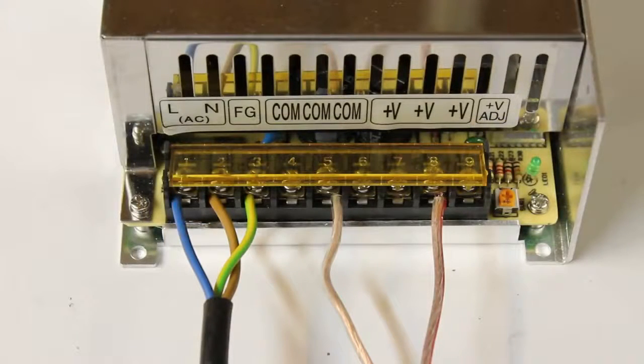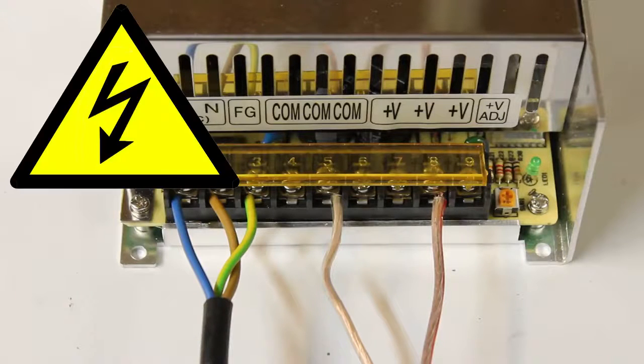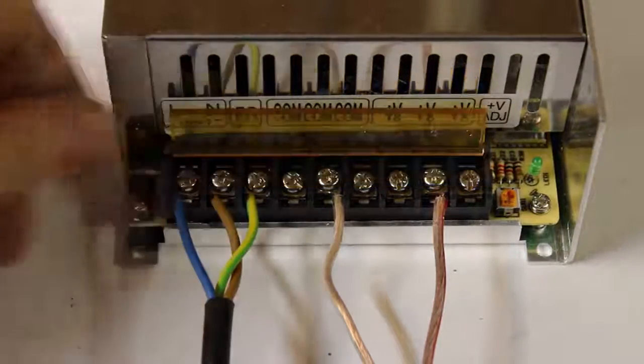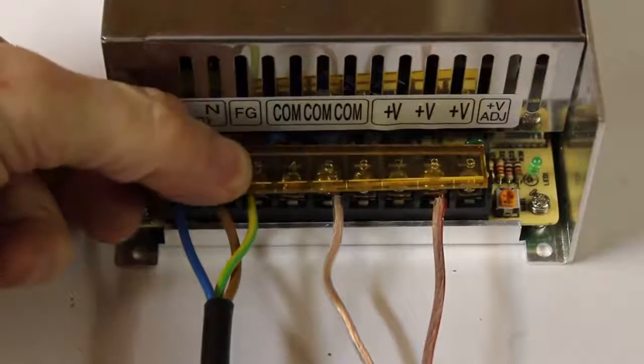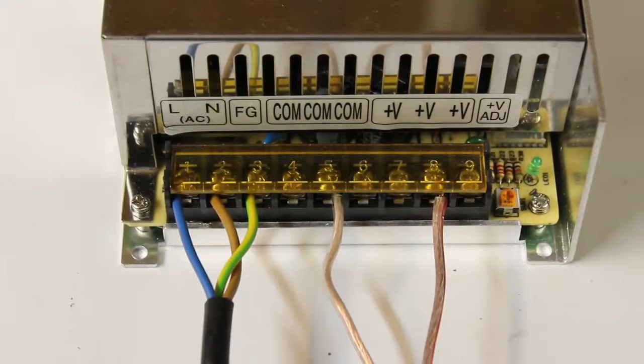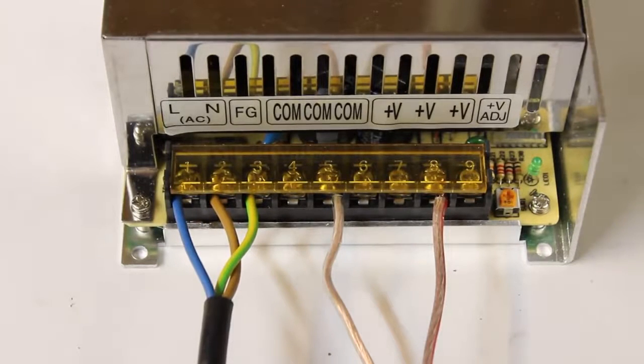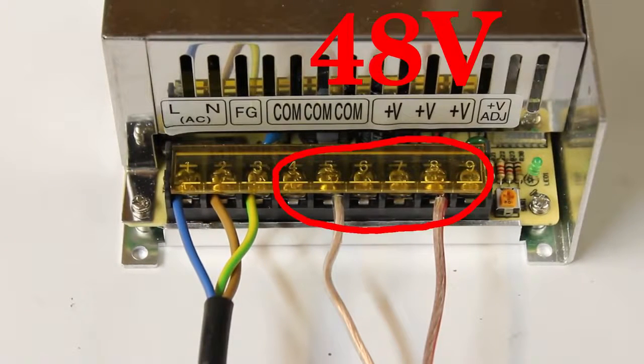The 400W motor was delivered with a 48V power supply. The insulation of this device is insufficient — the mains voltage runs to metal clamps with a poor enclosure. There is also no additional mount for the mains cable, thus there is no strain relief clamp. 48V DC voltage is not dangerous to life; nonetheless, better insulation is desirable at the low voltage end too.